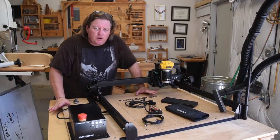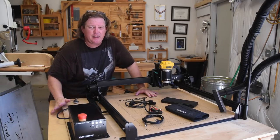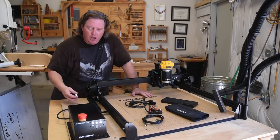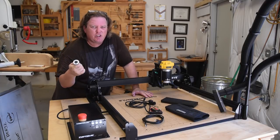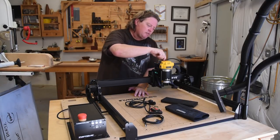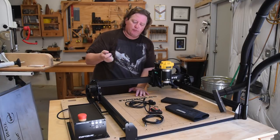It was a little bit more frustrating than the original one, but it is completely doable by just about anybody. It just required a little bit of thought. And the little nut up here, you can pick up these little ratcheting heads at most hardware stores. I got these in the $2 bin up by the counter. Pick yourself up a 10mm wrench, and it makes moving this Z-axis a whole bunch easier, and you don't have to build a little handle for that one.